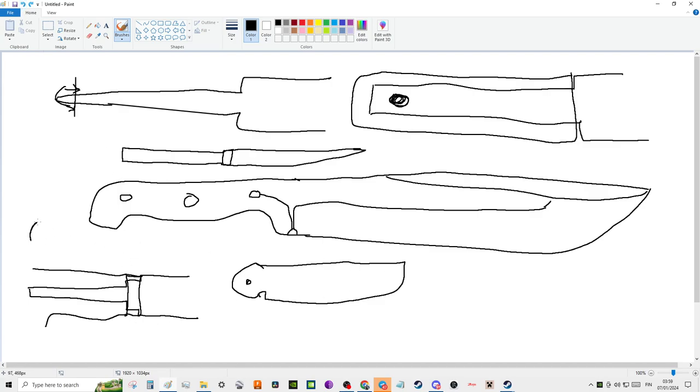If we have a little diagram here in three dimension, right? And there's the ring. The wood will come all the way through. And the reason I do this ring is because the ring prevents the wood from splitting. And then I peen this down and it presses up against the front.